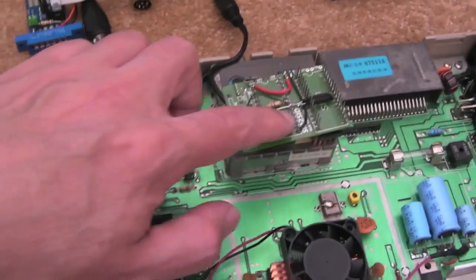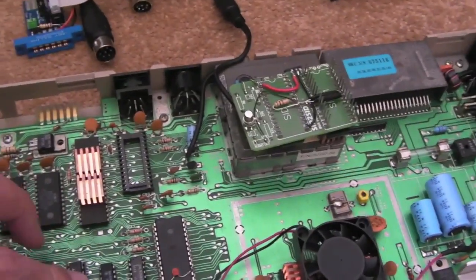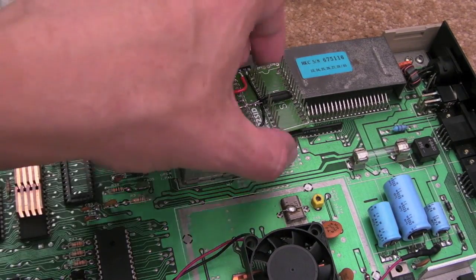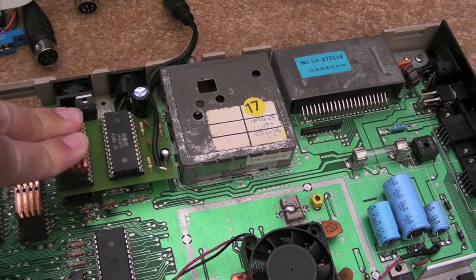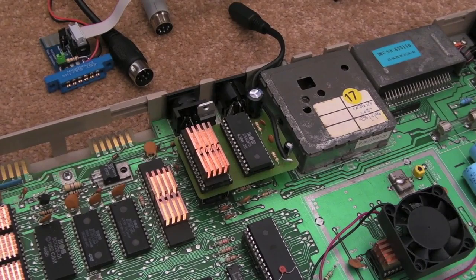I'm not too worried current-wise because the thing driving the chip select is the 139, and I tested that it wasn't even getting slightly warm. The worst case is it could stress the 139 as it's transitioning from high to low via the diode, but I don't think that's going to be a problem. That's all done - I'll put a diagram on this video to help you understand what I've done. Thanks very much to Dave Karan for being patient and pointing out the idea - I had thought about it, but not as thoroughly as he had.